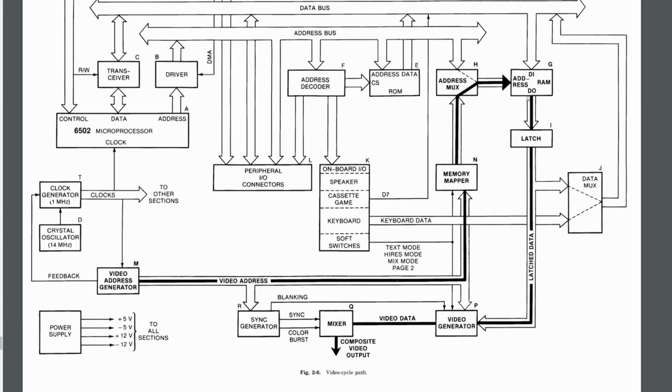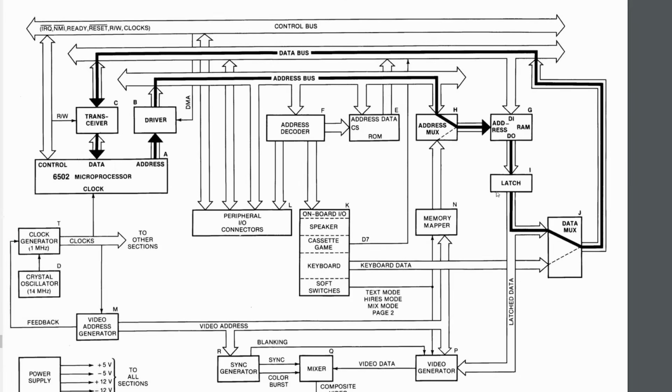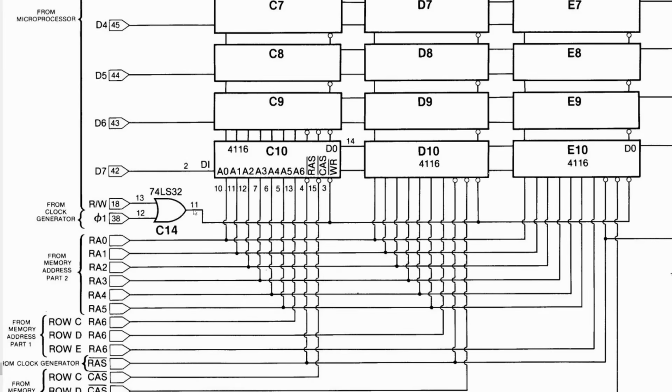This goes back to what I was talking about earlier, how the CPU and the display circuitry share the RAM, with the RAM running at double speed versus the clock speed of the computer so that they don't interfere with each other. As soon as the RAM chip was trying to display the lower 128 characters, the flashing or inverted characters on the Apple II, it was outputting a low signal, pulling it down to ground. And that immediately overrode that gate that was toggling the write signal on and off, essentially making all of the RAM writable all the time, or any of the time that bit 7 was pulled down, which immediately corrupted the contents of all the memory.